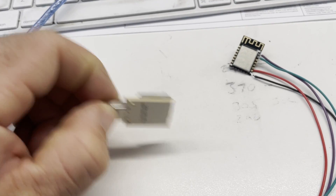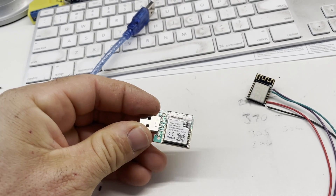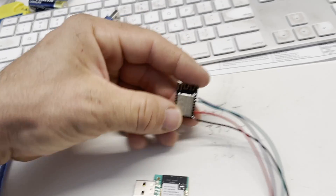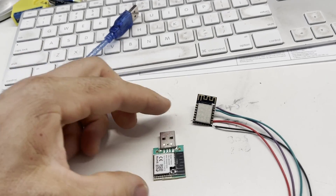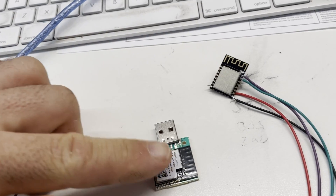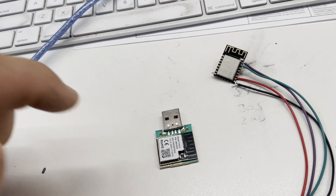At this point I thought the Tuya module was going to connect to Home Assistant, but I discovered it won't, and I spent many, many days trying to figure out how I could get it to work. Eventually I decided to try flashing ESPHome onto another module and swapping it out for the original one. All the plug is, is a connector carrying 3 volts, ground, RX, and TX, so with the Tuya platform on ESPHome that should work. So I'm going to try that.